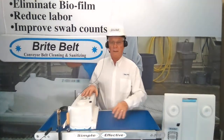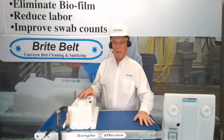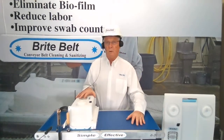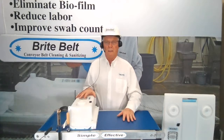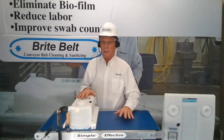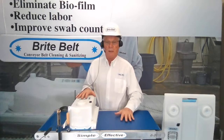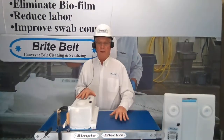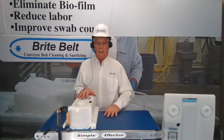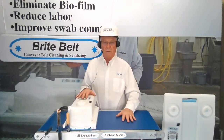Cleaning has some factors to it. One is the type of surface you're trying to clean: polyethylene, plastic, neoprene, modular link, stainless steel, stainless wire, roller belts. There's many kinds of belts in the food processing industries. Another factor is the soil type. What kind of biofilm are you trying to remove? Biofilms that are organic could be fats that build up, or oils or grease. It could be starches or proteins, sugars, or other kinds of biofilm that are organic.